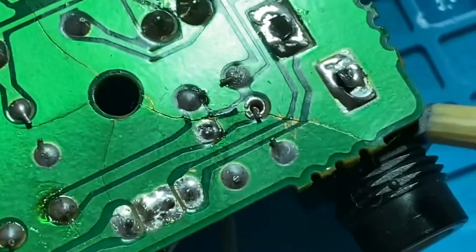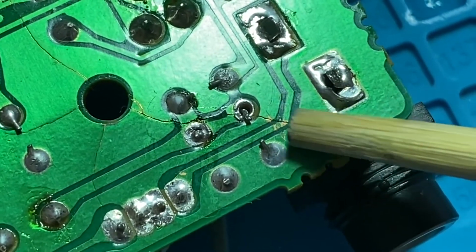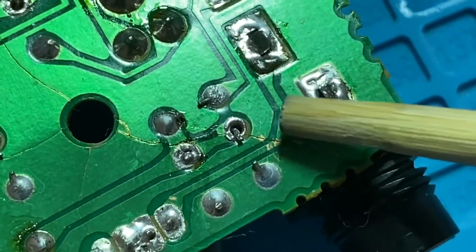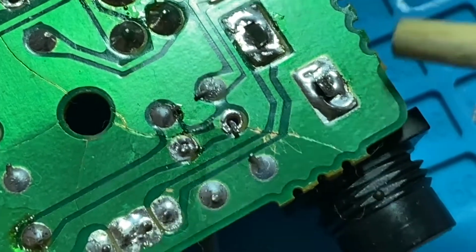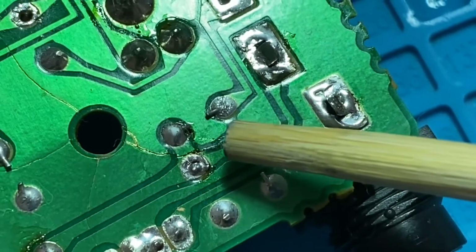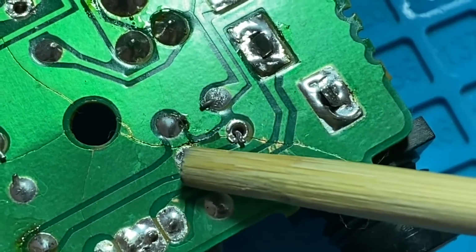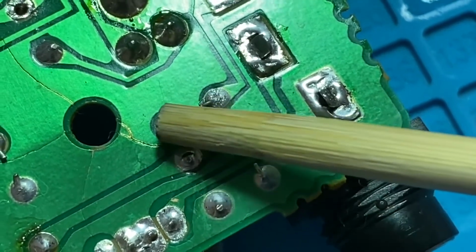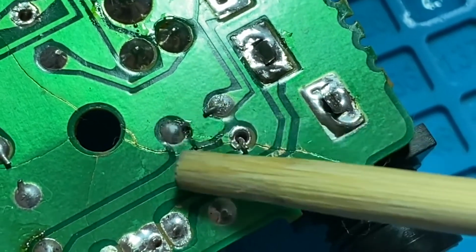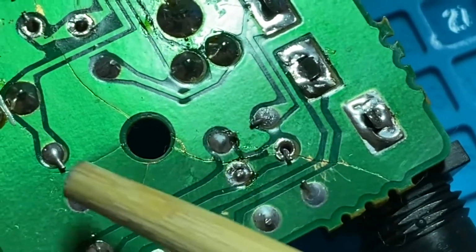So that would explain why they had all those jumper wires all over the place, because you've got a definite break there. So from that component along that trace to there, that's broken. It appears that maybe there to there is broken. There to there is broken, and they didn't have a jumper there. So that point and that point. So that's what all those jumpers were for.